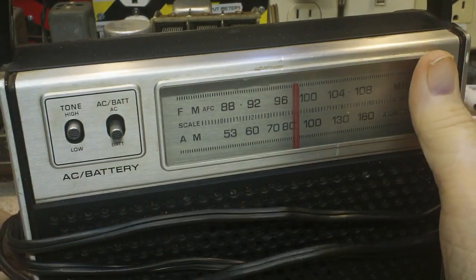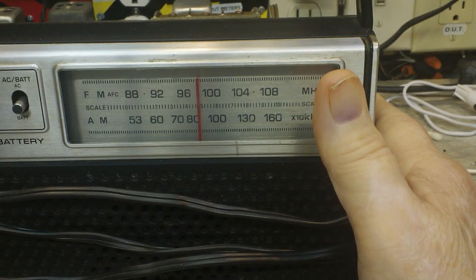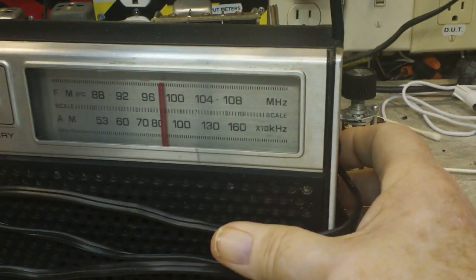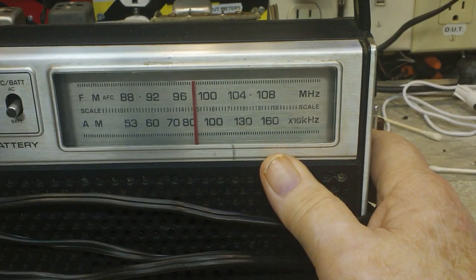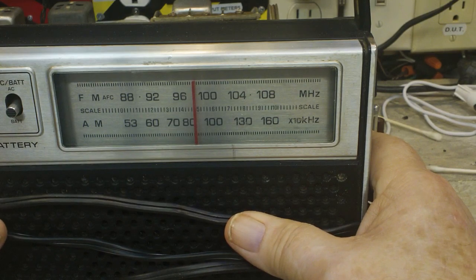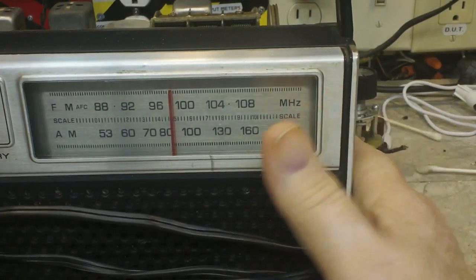This will probably go up on the shelf. I probably won't do much more with this, but I may do the capacitor if I can get this apart and get to the electrolytic capacitors — the E-caps. I might do that because it is a late 60s, early 70s radio, and that's long enough for E-caps. Even the later ones do finally go bad after a bit of time.